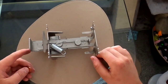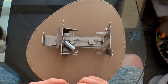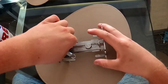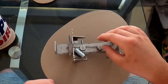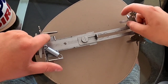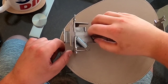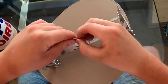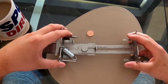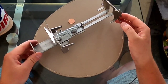So for the 225 or 215 block laid flat, brick on edge variant, you've only got to take out this left hand screw. So you loosen the right hand with a penny, then loosen the left hand side. The left hand side is the only one that's coming out for a moment. We check that out, and we just move our Fitzbrick all the way along, and tighten up the right hand side. Put the left hand side back in. There we go. We've just clamped them up with a penny clamp, nicely in tight. Then we slide this Fitzbrick back to the spring guide, and away you go.